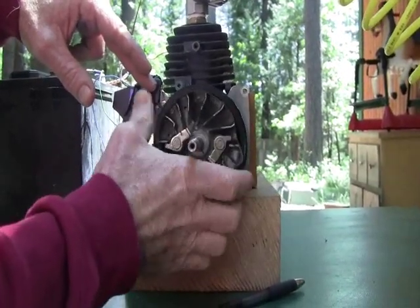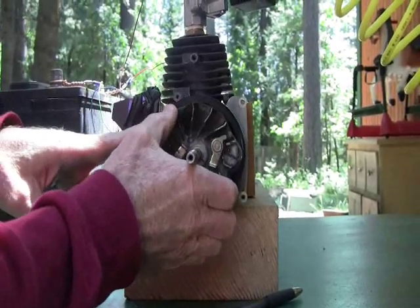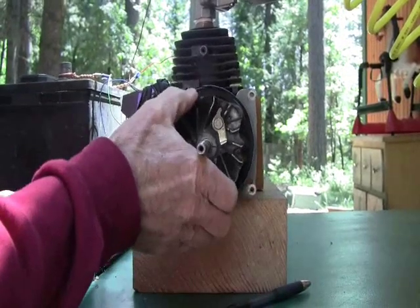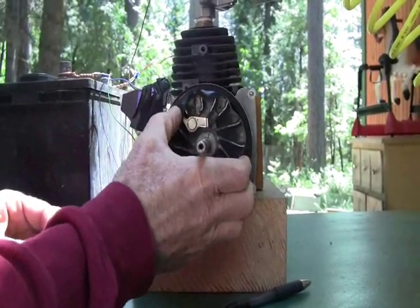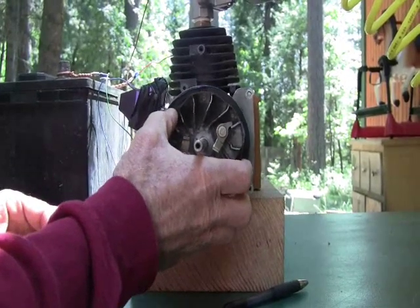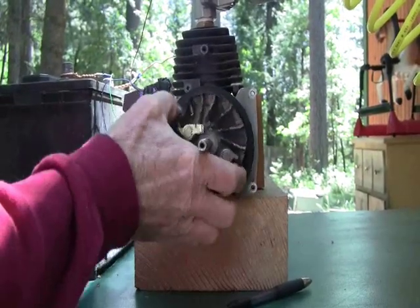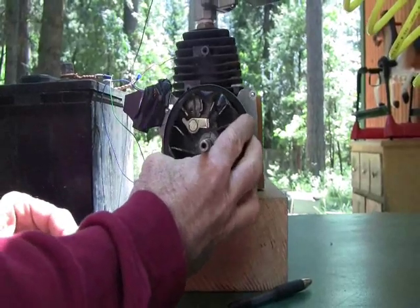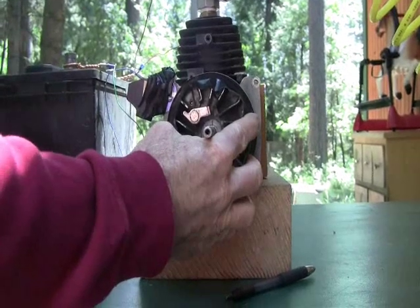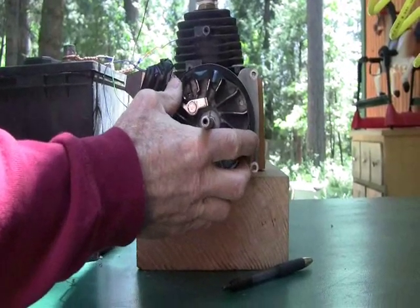Around the back side there isn't a build up of tape, so the plastic is a little lower. You can watch that again: it comes up, turns the switch on, that's going to turn the solenoid valve on and flow the air in. So the switch turns on give or take a little bit right around top dead center, so that it can push the piston down.